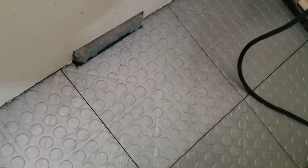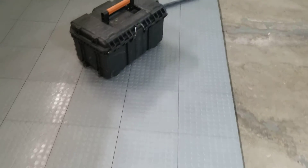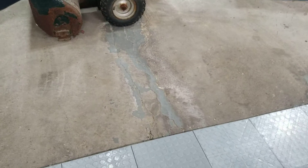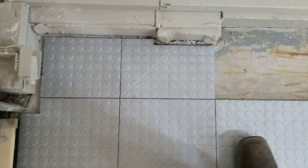You can cut the stuff and fit it around all the little pieces or imperfections in your garage. Your floor doesn't need to be 100% flat. If there's little bumps, or little cracks in the floor, you just put some filler in them. You've got to leave a little bit of a gap around there so that you have a little bit of expansion.